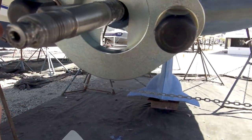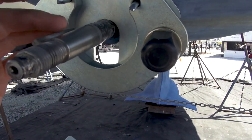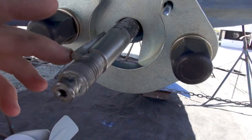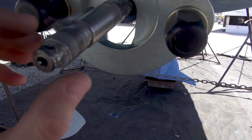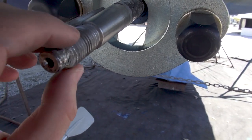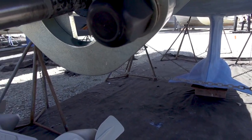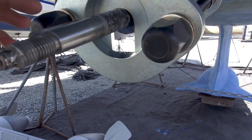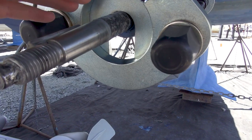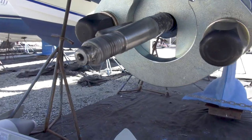In order to get the prop off you have a cotter pin that goes in here. There's the prop key right here — it fits into the slot in the prop — and then you also have two nuts that are screwed on here to hold the prop in place, and then the cotter pin is put in place just to make sure the nuts don't fall off. It's usually pretty difficult to remove because it's on there really tight and you get some gunk up towards the top that really solidifies and seals it in.